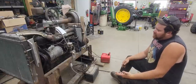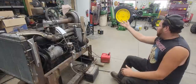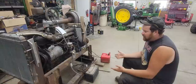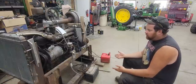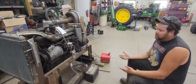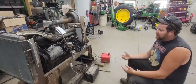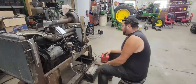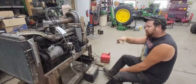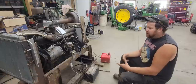Now, John Deere, they did this kind of thing with their unstyled John Deere A's, like the GP sitting back there. The idea was, once the engine got hot, you could switch it over to a cheap burning fuel like kerosene or maybe a little diesel fuel, and they would run on it because they were good and hot and they could vaporize that fuel. And that's what I think they got going on with these lines all around the block, is by circulating that fuel around the block, they got it hot before it went in the carburetor, and then it would vaporize and it'd burn.